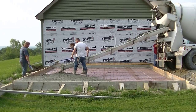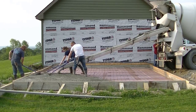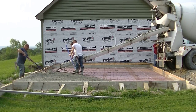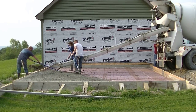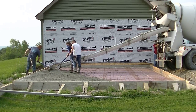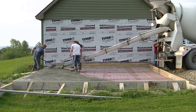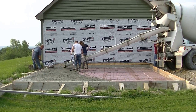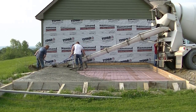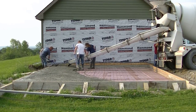You can see Darren, Luke, and Abby tugging the wire mesh up with their come-alongs, getting that wire pulled up so concrete flows under it. This slab is 24 by 20 — we're pouring 11 yards of concrete, all in one truck.